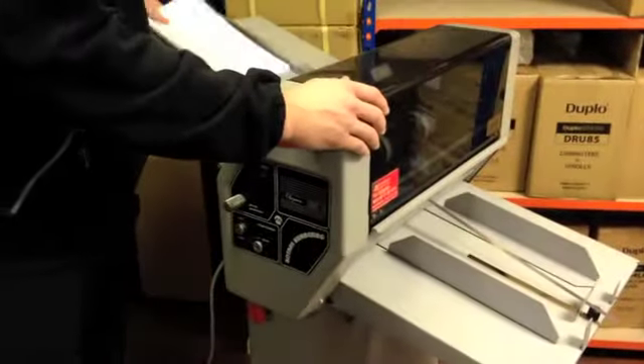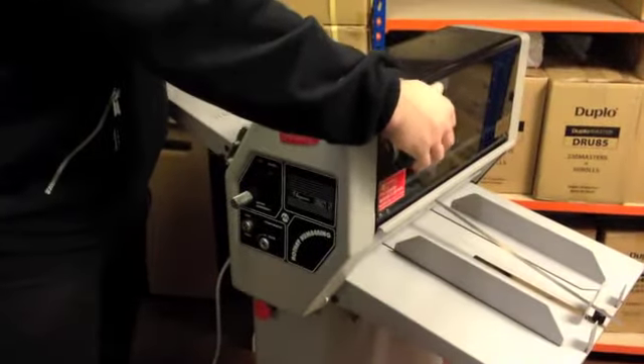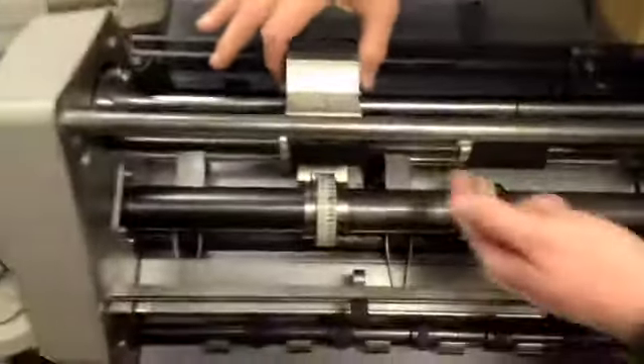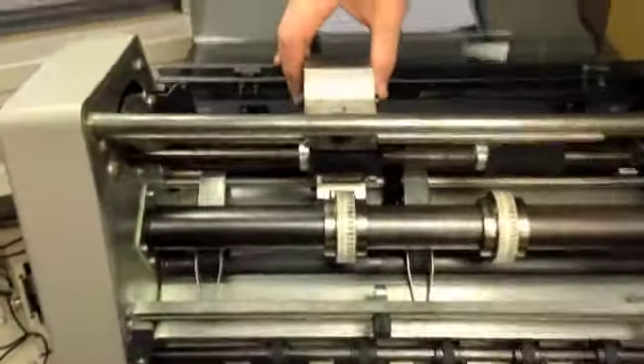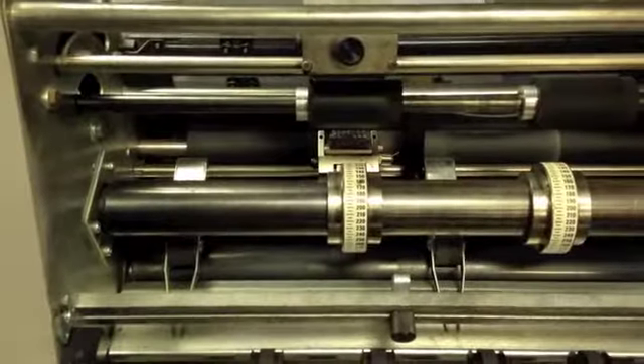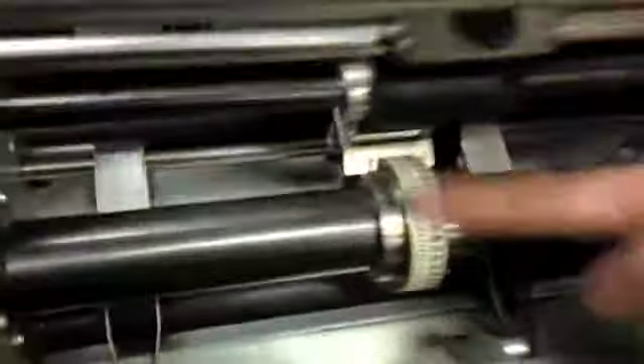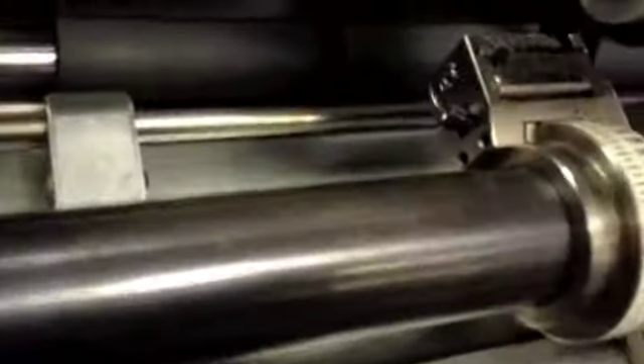Very simple and easy machine to use. I'll just show you the inside so you can get a view of it. There's a perspex cover, and this is the ink pod assembly that runs onto the transfer roller — that's what inks the box up itself and transfers it to the print. The box is quite neatly located on this cam here; the numbers reference to where they are on the sheet, and it's a rough guide.